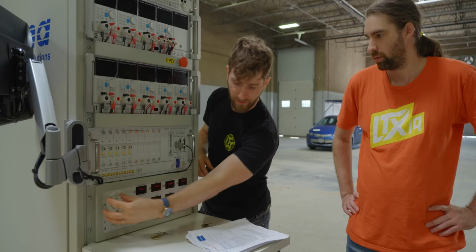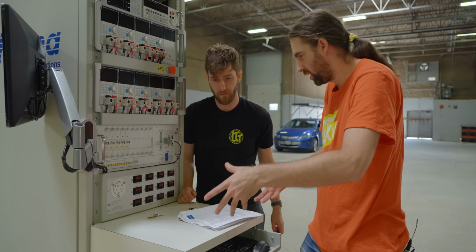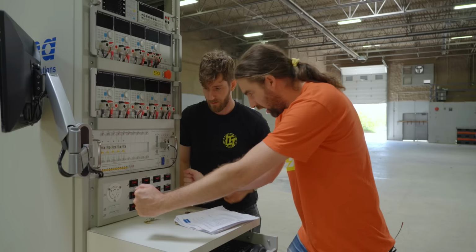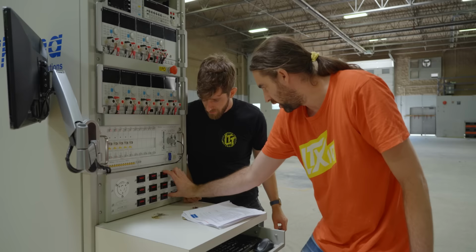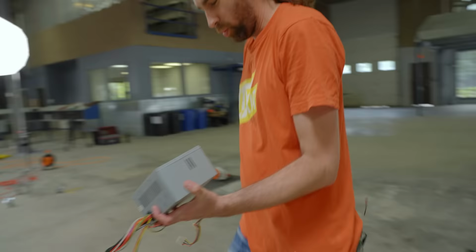With an adapter. So the idea with this is to have a test enclosure that we put down here and plug into this. Or we even make a backplane that just slots in, because these are all very precisely put in place. So we could easily have a PCB with Anderson connectors, the PCB mount ones, not regular ones, that we could just slide in. And there's power. These are all your signal stuff that goes up to this guy and this guy. And these channels, I believe, are temperature sensing channels that is a byproduct of this guy. So this is basically the business end where we plug the victims in.